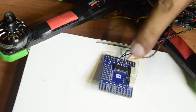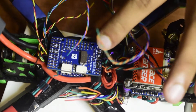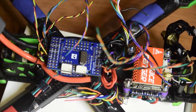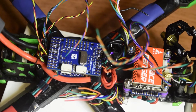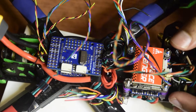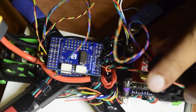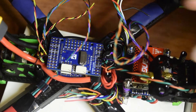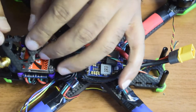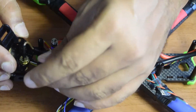This is how you connect the VTX wires to the Matek F765 drone flight controller as per the wiring diagram. Once you boot up the flight controller you'll be able to power the VTX when you connect the battery. One thing that is super important: you must connect the antenna before powering the VTX, otherwise it will immediately fry your video transmitter. The antenna holder goes on top like this, with the holes matching the holes on top of the spacer.